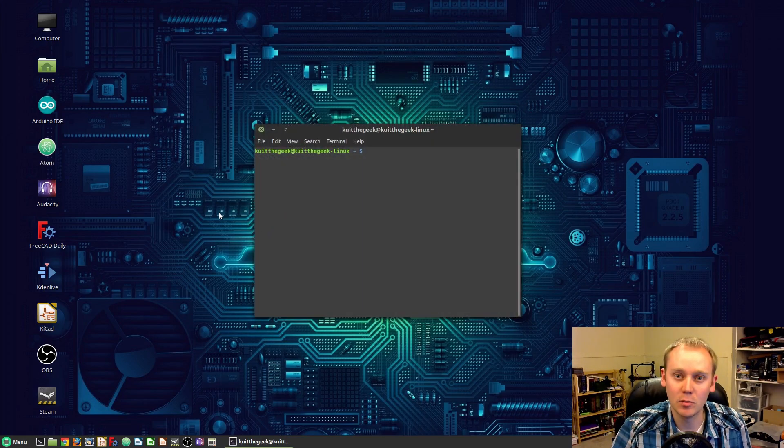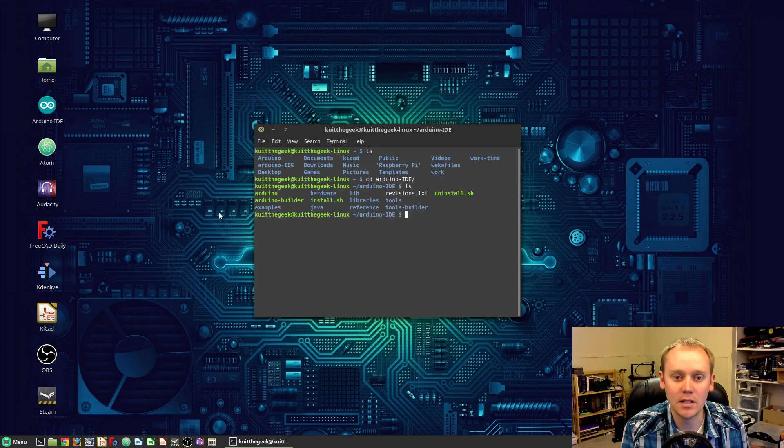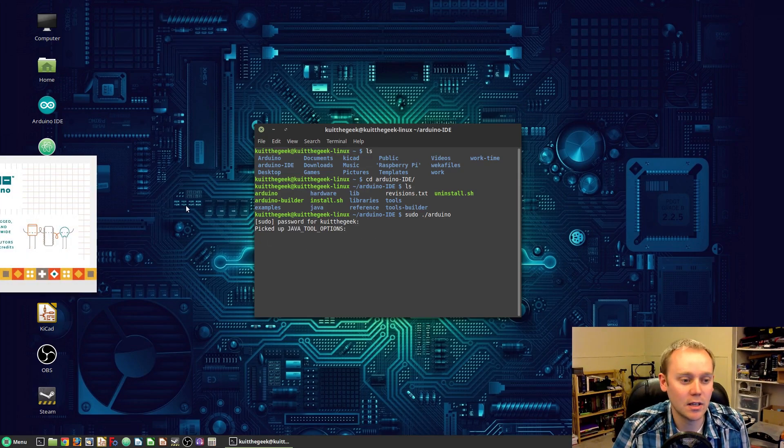So I'm going to open up my terminal here. This is something you don't have to do — there are other ways — but this is what I find to be the fastest way. If I take a look at my home directory here, I have arduino-ide. We're going to change directory into arduino-ide. The way I do autofill on Linux is by hitting tab. We're going to do a list and see what we have in here. There is an arduino program listed right here, and we are going to run that as root using sudo ./arduino. And by hitting that, I'll put in my password. You'll see it's starting to come up, and there we go.